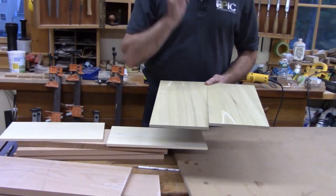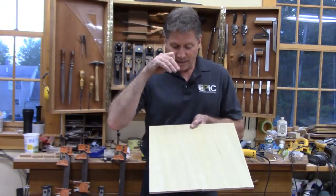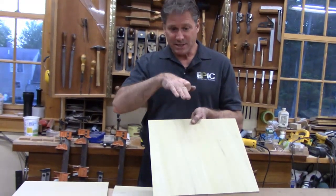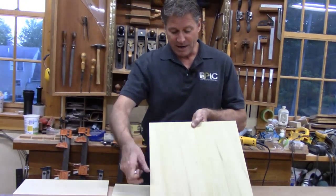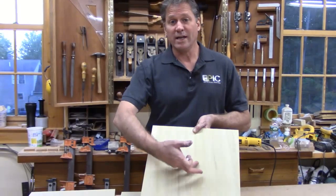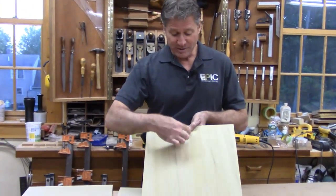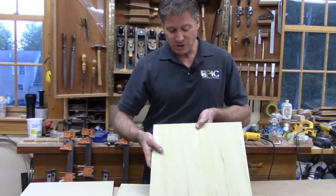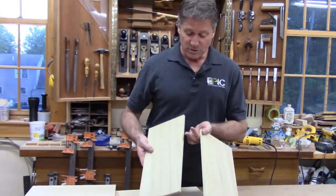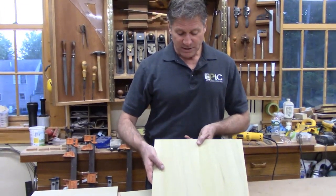Light gets absorbed into the end grain, and it looks very dark. So, light is more reflected when it's coming up behind the piece. It's reflected. It's not looking into the end grain. So you've seen that when you've walked around the table, or maybe you've wondered why a glue joint has shown up so much when you put the finish on later. And you see how hard the line looks, even though you did a good job matching. You have to take note of the way the grain is running on the edge when you're making a glue joint as well. So that's another factor.